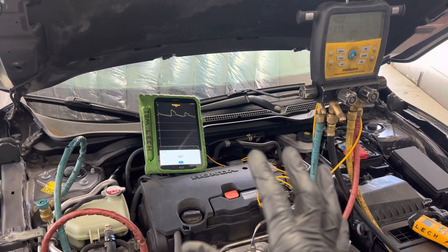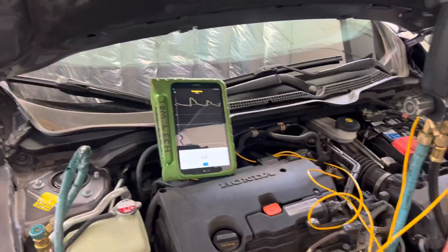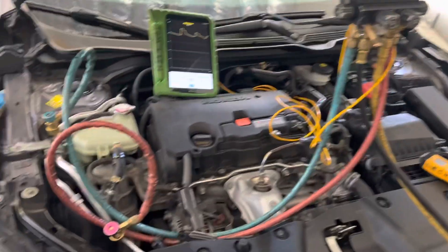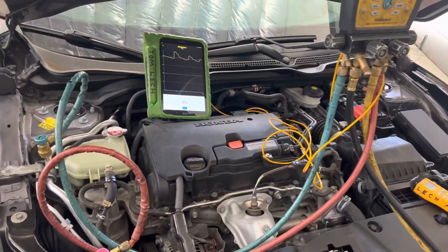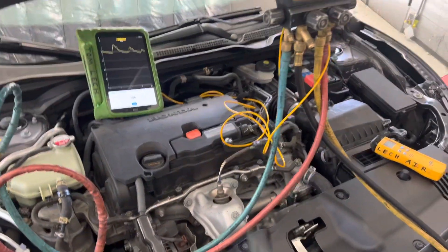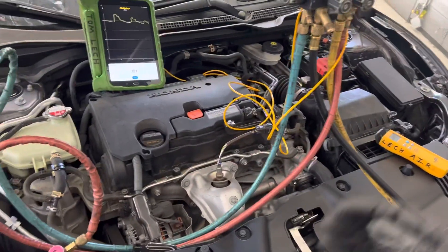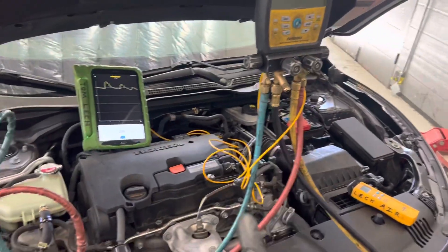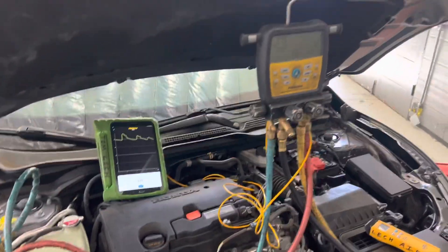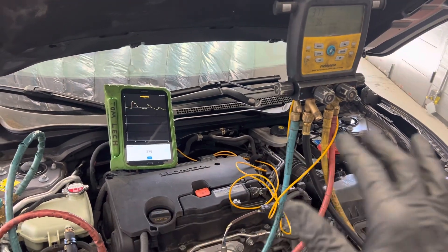No more of this 1950s junk — cans with little funky gauges. Look inside their gauges, look at all their o-rings and seals — you always find nicks and scratches in those o-rings, and that's how they leak air back in. You get guys saying, 'Oh, when I turn off my vacuum pump I switch my hose over really fast and charge it fast so I don't get as much air in.' That's the problem right there — 'as much.' You either get zero in or you get some in. There is no in between. Do it right or get out of the trade.